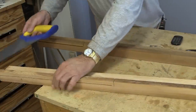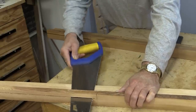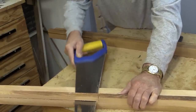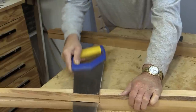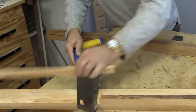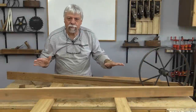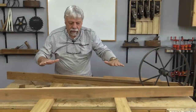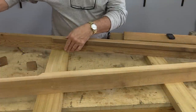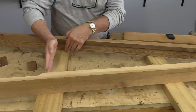There are those cuts, and I'll just finish those off by hand. Let's take a quick snapshot of where I am at the moment. What I need to do is put these cross member pieces in. I've measured from one end so that I know they're going to be parallel.